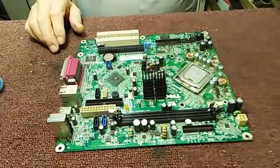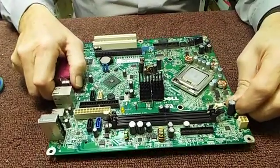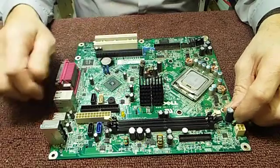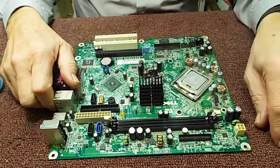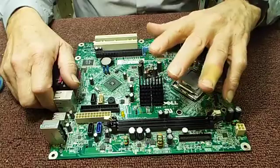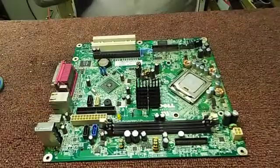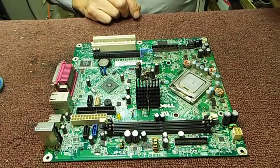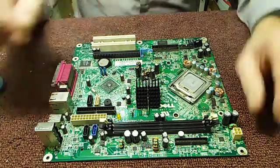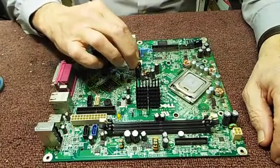Hello, welcome back to my shop. Today we're going to take a look at the best ways to get old bad capacitors off of old motherboards. As you can see, we've got three of them here. You've got to remember a motherboard is like 8, 10, 12 layers thick — pretty densely populated with a lot going on between the layers. So the trick is to get these things out without ripping the feed-through connectors off.